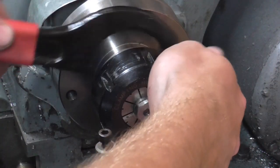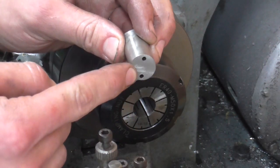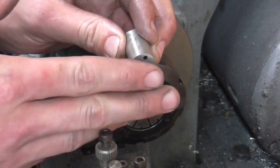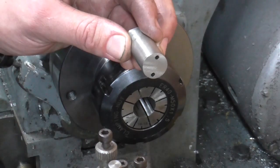I'm now going to remove the part, clean everything, and reverse the component to reveal the two pin-spanner holes. I'll then drill, tap, face off, skim the OD, and part a couple of blanks off ready to finish the reverse side. To hold these nuts the other way around I could make a little fixture or use a three-jaw chuck, but when making an assembly of components I often look for opportunities to use components within that assembly as fixtures. This can save making a special fixture and can be quite accurate.